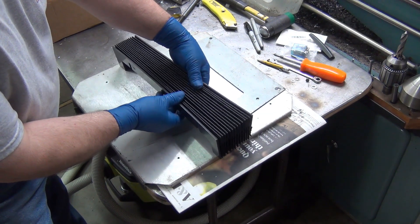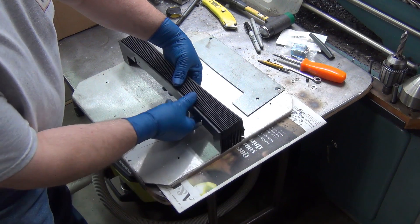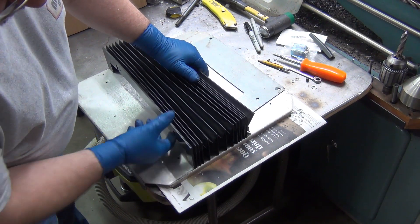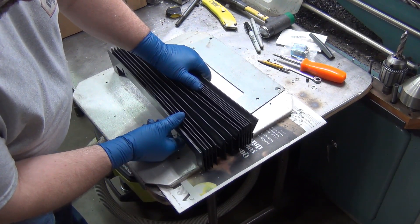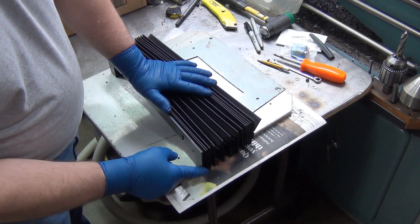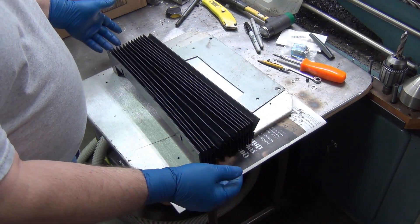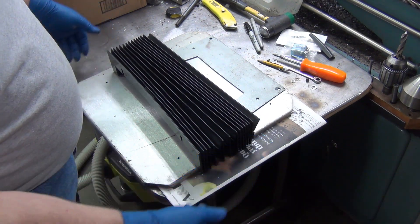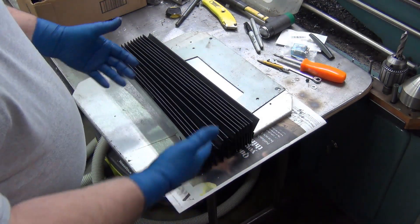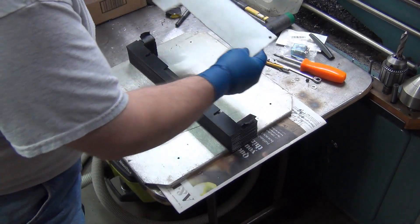The plastic holds it as it sits on the way — basically it sits on the edge of the way like this, and when they open up you actually get chips right on the way. What I'd really like would be for that to be widened and extended. If it was one inch wider on each side it would definitely help keep chips from getting and sitting on the ways, getting rubbed back and forth by the bellows and the table saddle.